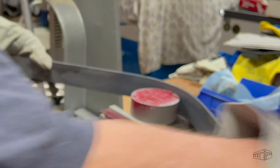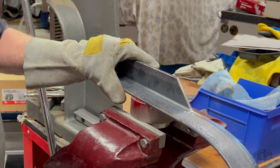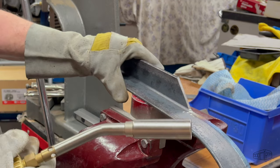I can't recall if I used heat to bend the small folding bar — it was a long time ago — but this bar is 5mm thick and the web is 15mm, so it's going to need some heat.